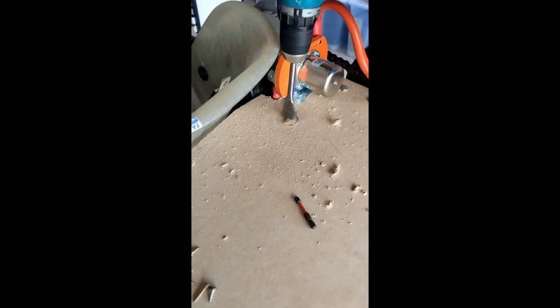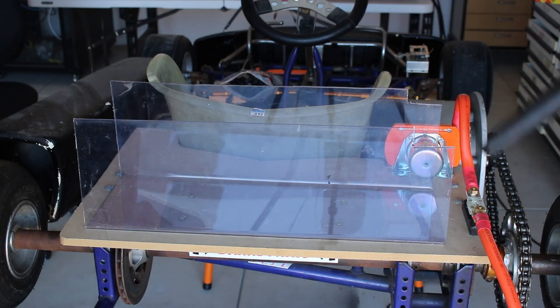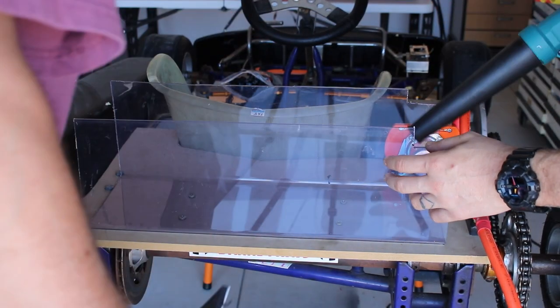So that's one good thing about having the battery shelf made out of wood. We can just make holes for cabling really easily, and fixing things like the battery housing to it is a breeze as well. For the housing, I was just able to use some wood screws, then I put a piece of dense stick-on foam in the base for isolation and mechanical protection for the batteries.